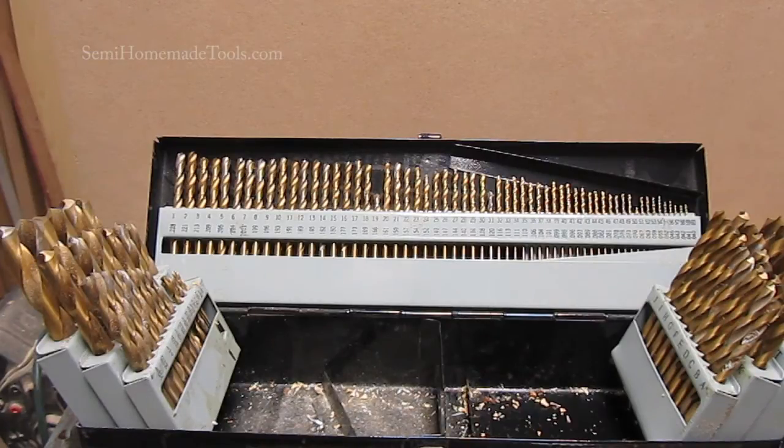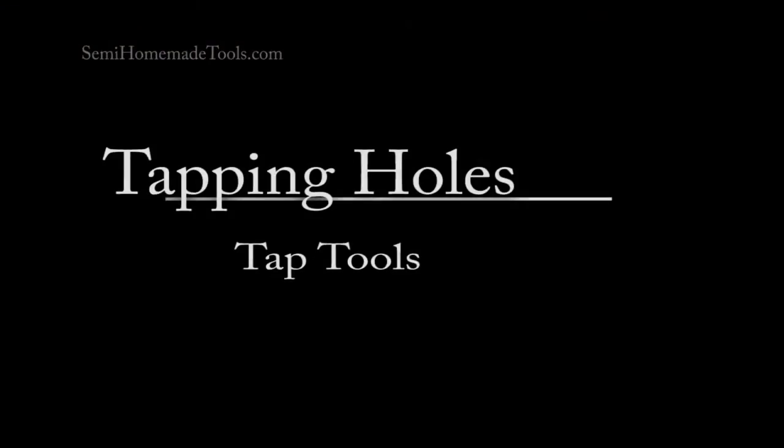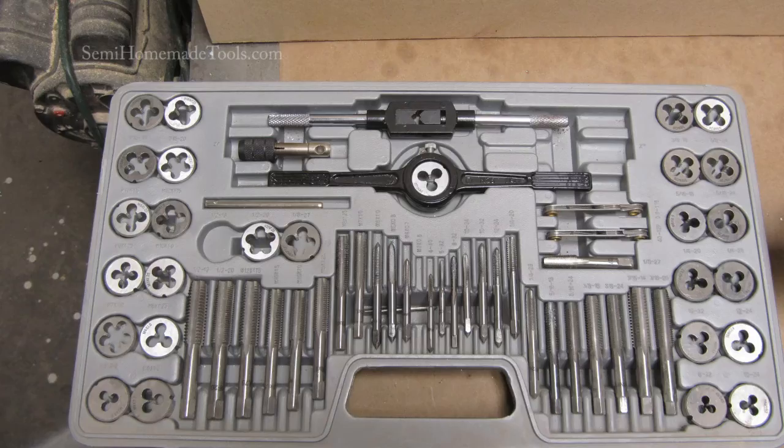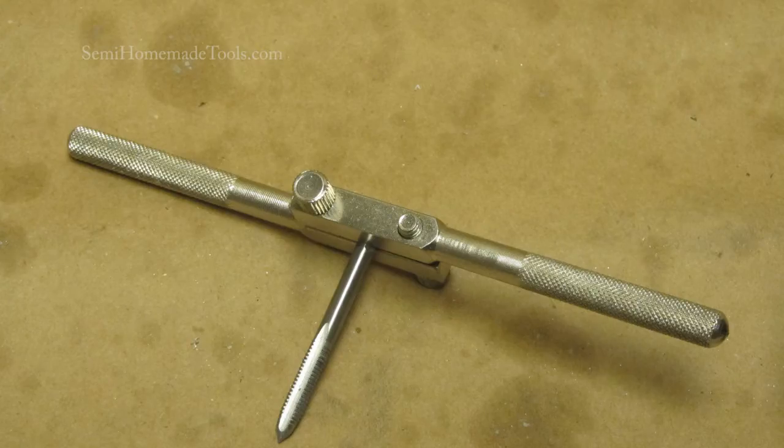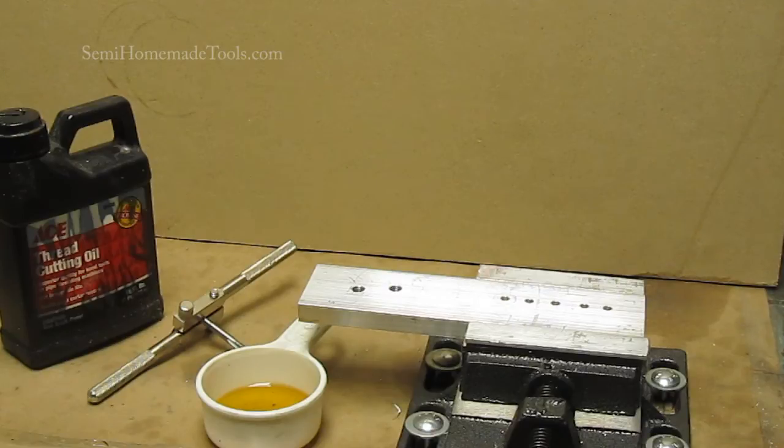These collections can come very inexpensively or very expensively depending on what you need — I tend to go to the lower end, but this is a complete set. Besides the drills, you're going to need the actual taps. This is a tap and die set; it's used for both tapping holes and for cutting threads on rods to make bolts. These are three different types of T-handles, and it's really a matter of personal choice. This is the one I use most often — it seems to be the most secure and holds the tap the best for me.